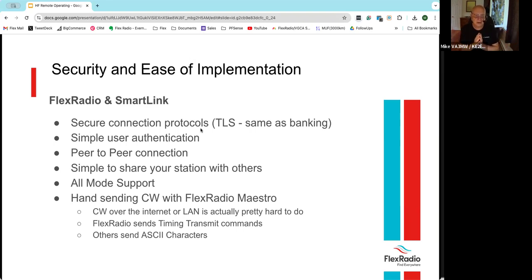And there's a couple of guys that have come up right now with solutions that work for hand sending CW using a couple of Arduinos. They use our timing element technology. It's beautiful. I'm on a couple of chat groups for it, and the guys that are implementing that are having a blast. It directly integrates to a FlexRadio, but he's also got a client server thing where it connects to, can be made to work with any radio. And of course, it's much faster because the latency on the character is only the length of the last event, the space or the CW carrier.